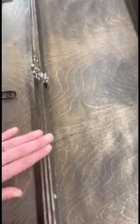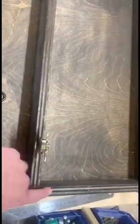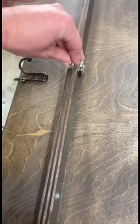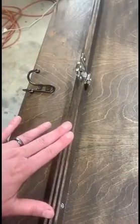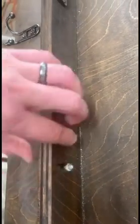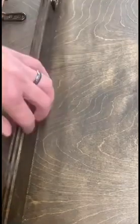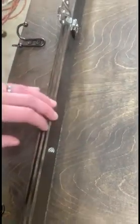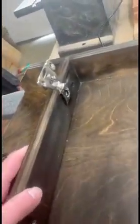The next piece we're going to work on is the bottom brace. This helps to complete the cabinet, but what makes it most important is that this is where all your weight is going to be. Your door, whenever it folds down, actually hangs from this, and all the weight is pulling down. So this is the one you need to secure the best. I have several pocket holes, it's glued, and then to join it to your sideboards — again, pocket holes. The reason for securing it to your back is so whenever your door folds down, it doesn't want to pull away from your base.